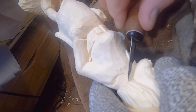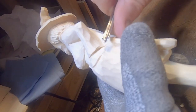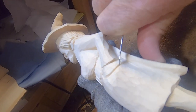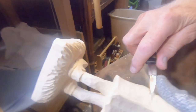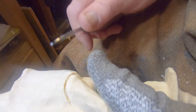I'm going to work on where that hand is tucked in that pocket, right here like that. It's not much — I started a little V-cut right along there and you just follow your line across here. Then you go in and make a stop cut and cut back against that and kind of push that back down in. That's about all we need on the hand being tucked in — you don't really see a thumb or anything like that. I will shave this down just a little bit.